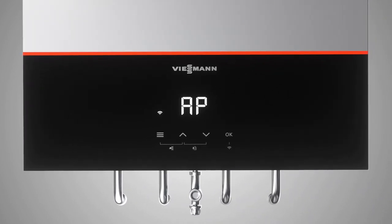If you want to carry out commissioning using the boiler display, press the Menu button for approximately 4 seconds and C1 will appear. Start the filling program. The display shows the pressure in bar. To end the filling process, press the Menu key for approximately 4 seconds until the next step appears.